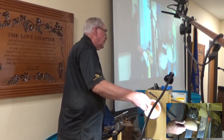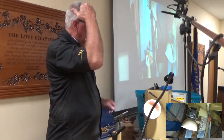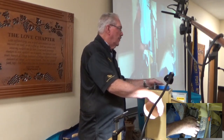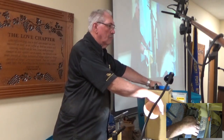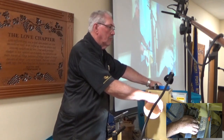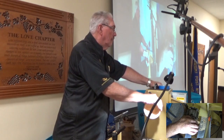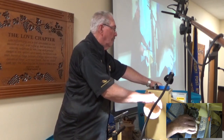Card scraper only, or you sand it after? No, you sand after it. So that would just keep from getting all the muck in your sand. Yeah, it takes the surface shellac off, but it goes into the pores. You lightly sand it after. Yeah, we'll sand it, just start it on finishes at 220.